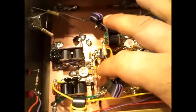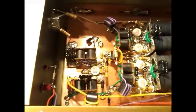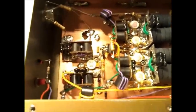And you can see that this 4.7 is charred here. I always like to double up on two 4.7s right there if I can, or just put something heftier. I usually put about two 4.7s myself. We're going to be taking this variable out. I've seen people starting to use these variables, but there's something about the variable itself having some problems. Texas Star used this style, but in a 20 ohm, and it seems to work just fine. But I don't think it's a pure 2 watts, if you ask me. I think it's more like a 1 watt variable. Other than that, there's a few other things I'm going to change in here.